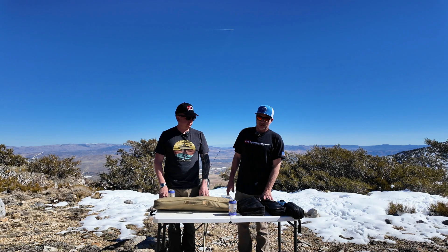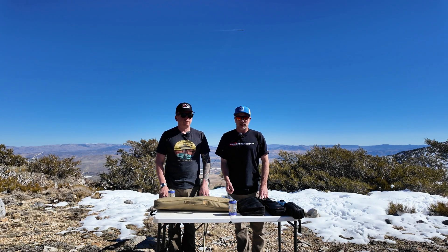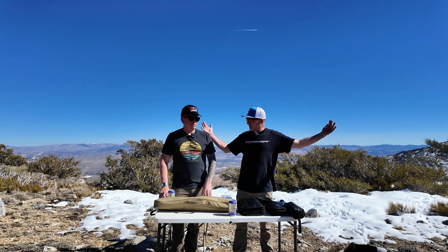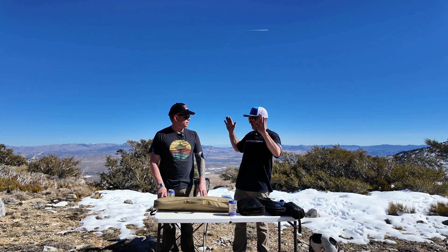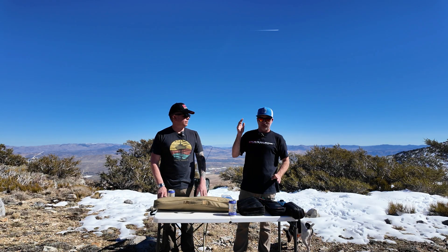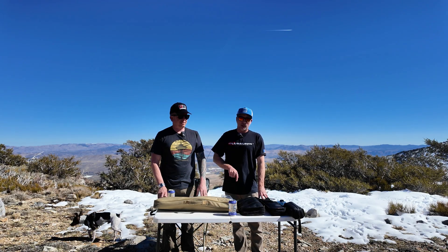I brought several whips today. What I'm going to try to do is get two of them — I believe you want two quarter-wave antennas a half-wave distance apart, and then the radiation pattern should be in line with the antennas. Don't quote me on that, but that's what I'm under the impression from what I've been reading. Please comment below.